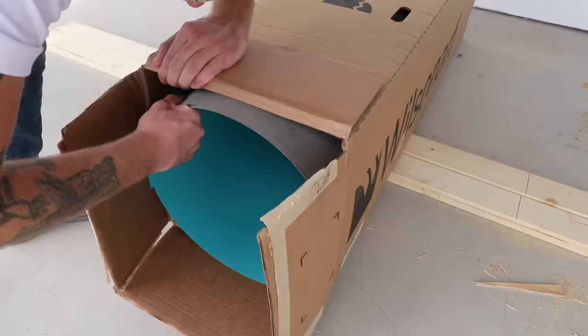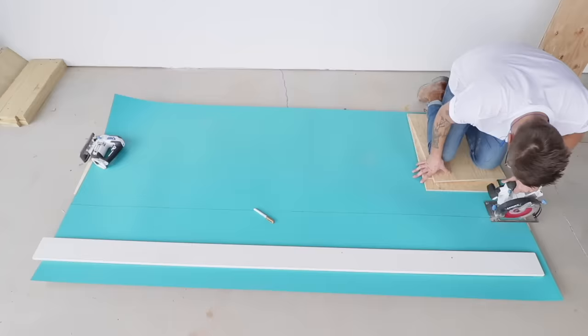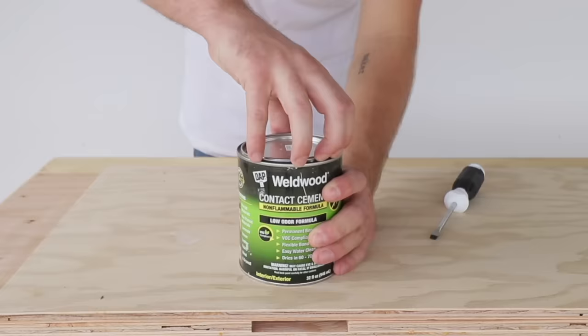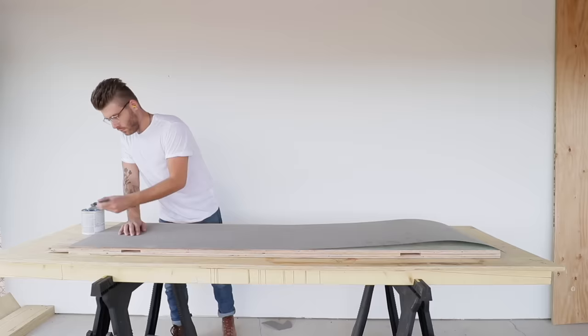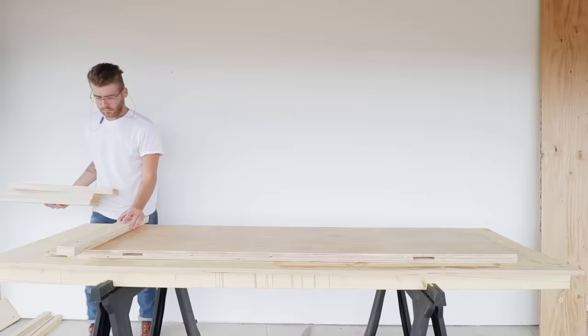In the last episode of this bus series I used orange laminates to create monochromatic countertops and kitchen cabinets — during that whole process I completely fell in love with it. So for the office desk I'm going to be using blue laminate to face the tabletop. What's so cool about laminate is it's so easy to apply and gives you such a durable finish. All you need to do is apply a couple of coats of rubber cement or contact cement to both the laminate and your substrate, then give it time to dry completely to the touch — you don't want it to be tacky whatsoever. For me that took about 10 minutes, but on the can it says it can take up to an hour.